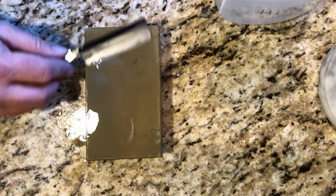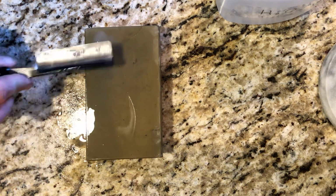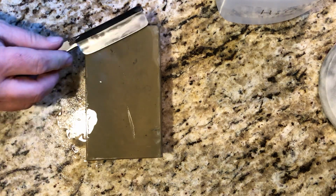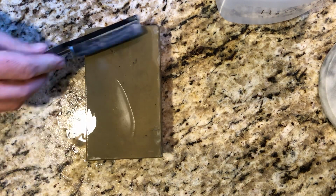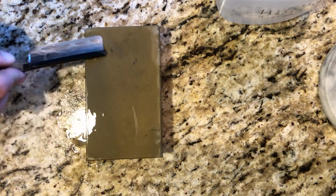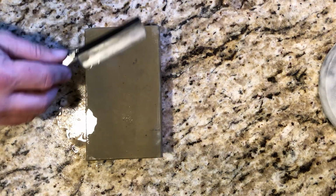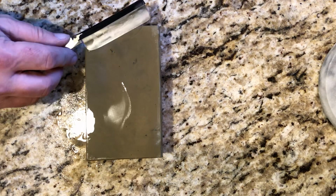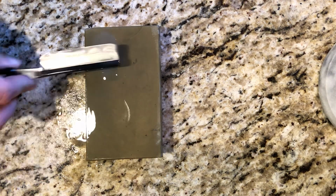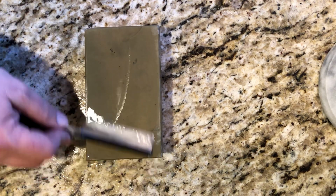Now again, you have to test your stone, your preferences. Some guys like a crisper edge, some guys like a softer edge, and that's where varying the amount of slurry at the end is helpful. As a general rule, I haven't enjoyed shaving off a plain water JNAT. You could do it, I like just a little bit of slurry.